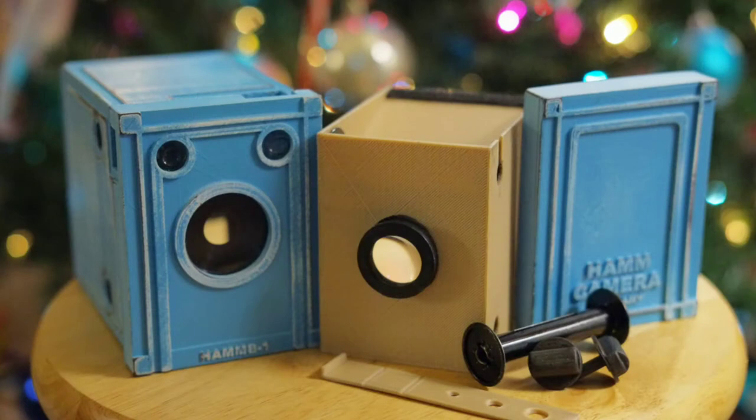We get a great image. Early on, using this 95mm focal length lens, I was able to get really great sharp images as early as six or seven months ago once I began finalizing the cartridge design. That's very exciting because it's the cartridge which holds the film firmly in place, acting as a pressure plate with tension that allows the film to be focused properly — the image to be focused on the film properly. Good thing to know, we got that right out of the box.